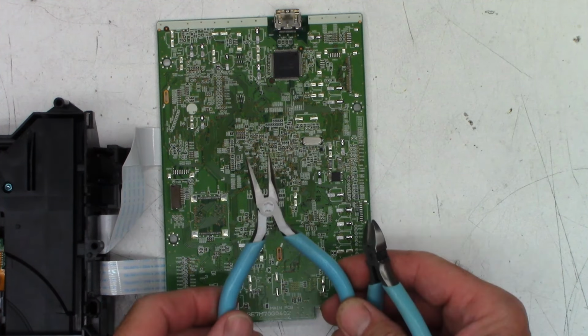Okay, happy with that. Ribbon cable. We need to reconnect that ribbon cable right there. And the easiest way I found to do it, which I won't be able to show you. Well, maybe I can. Let's jam something under it right there. It must be elevated to do it correctly. Yeah, I know you can't see anything. But there, it is reattached. When you put this back together, open the VHS door, because this little hook right there has to go up under this little flap right there.